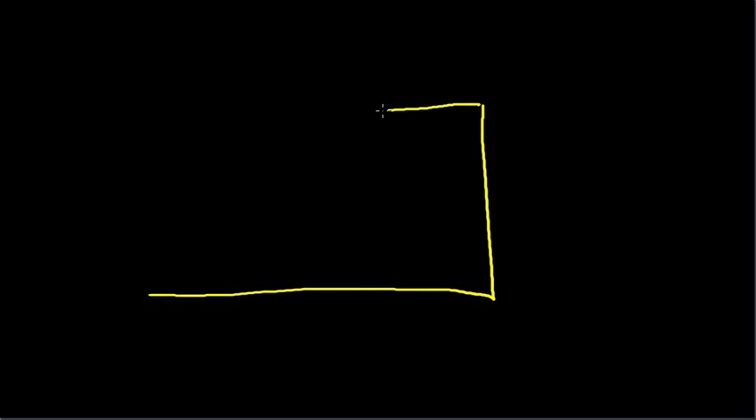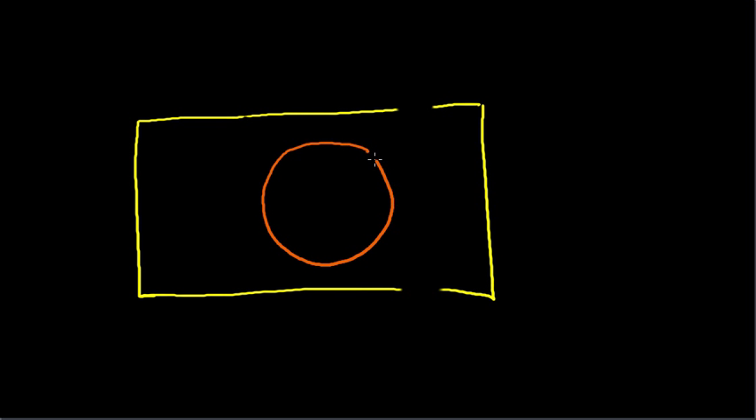You've got the artificial horizon here, and it actually has got an opening here and an opening here. Within the instrument you've got a gyroscope itself, and on it you've got a display face over here. The gyro instrument spins, and through a system of gears and linkages, the gears and linkages proceed off to the display, they cause the display to move, and that's what's going to turn the face of the instrument.